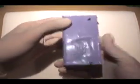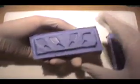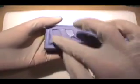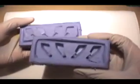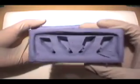Okay, so this is a 2-part mold that I actually casted first. Basically what we have here represents our original clay base. I just laid the flattest part of the pieces in there, and I'll just let them sit there while I poured my other half, which we can see has the deeper grooves. The majority of the piece is in this part.